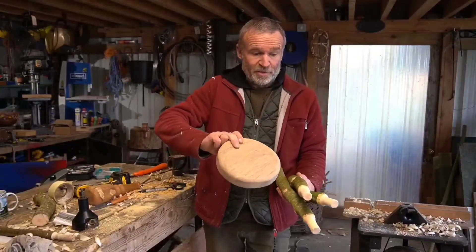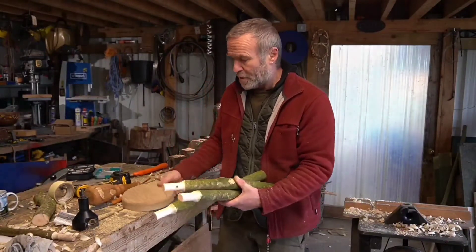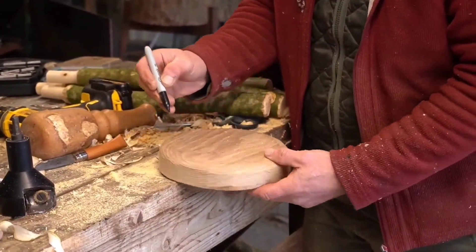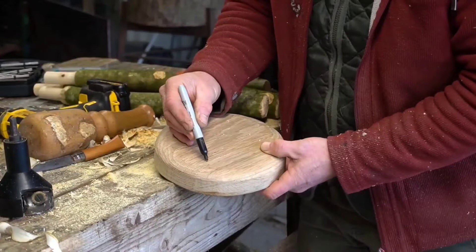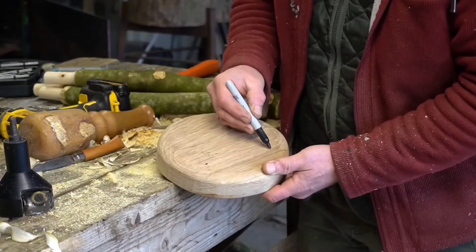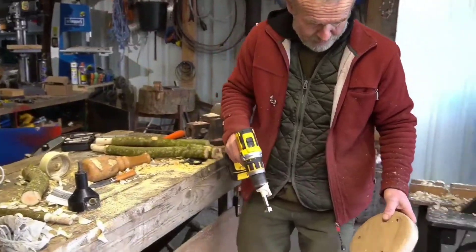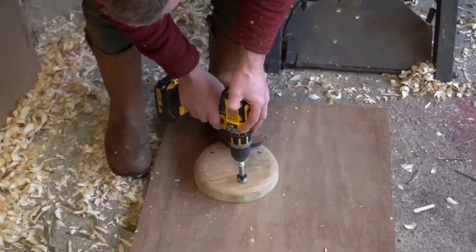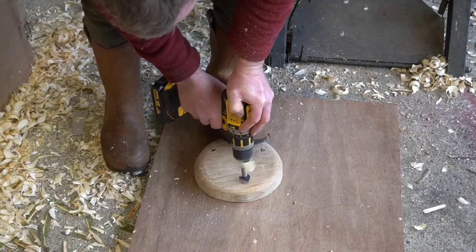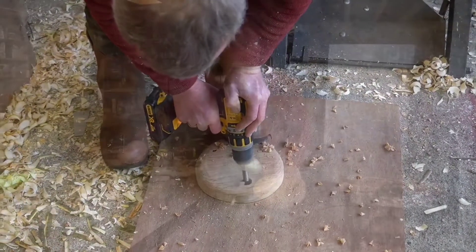Now we're going to use this piece of top and we'll show a slightly different technique, because what I'll do is I'll bring these straight through so that we can see them on the top. I'm trying to miss — there's a little split there and I don't actually want that too much in there. So I'm going to do my holes there. I'll draw a triangle now, roughly. I'll drill these down on the floor actually because it'd be handy to put my foot on it. Now I'm going for the angle again — we'll start off flat and then go to the angle. The hole's drilled.